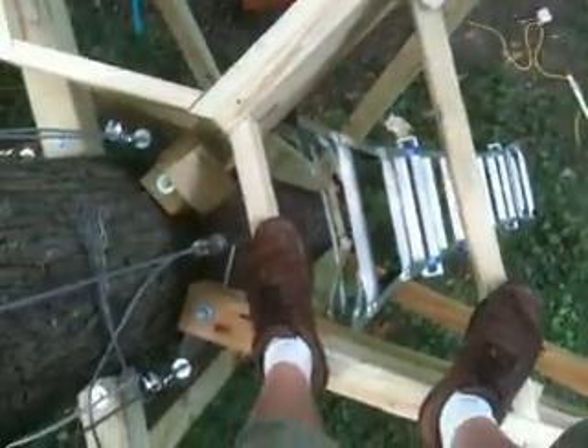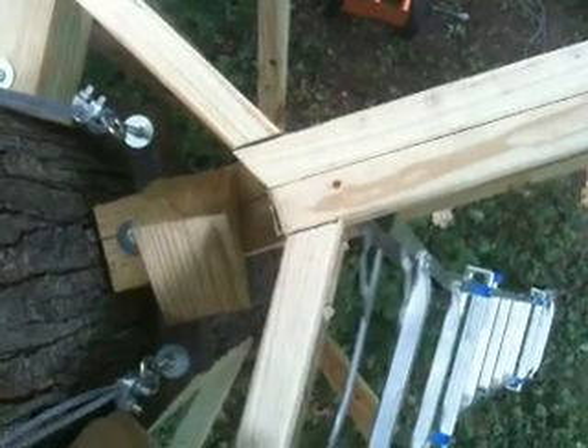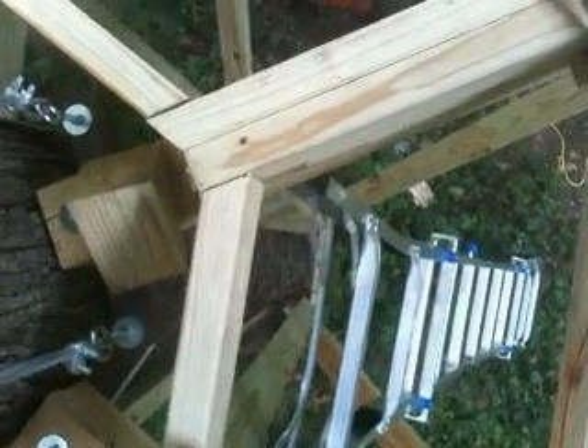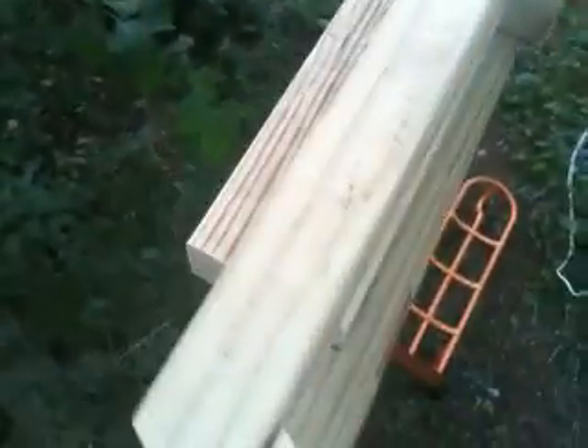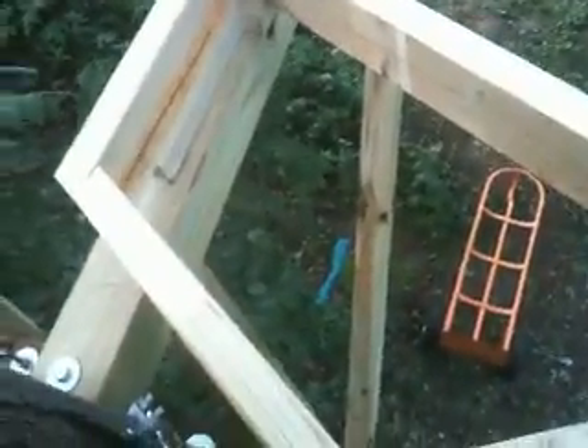I am now standing very carefully on top of the first joist. Got the second joist in also. Had a little trouble keeping my design standardized — I didn't make the shape of that thing quite right. So the outside is lined up pretty good, but the inside is going to have to follow the design first. I had problems with my angle — I'm losing some angle. The bearing weight will still be on that piece, but I need to make the next piece a little smaller in its dimensions. These cross pieces need to be a little smaller so that they actually fit correctly.